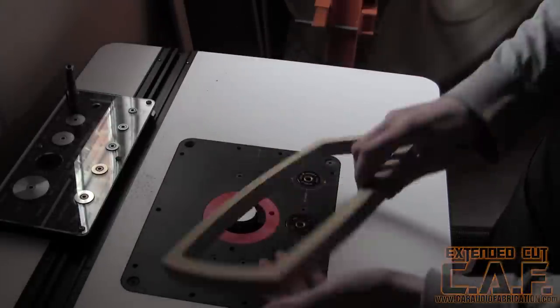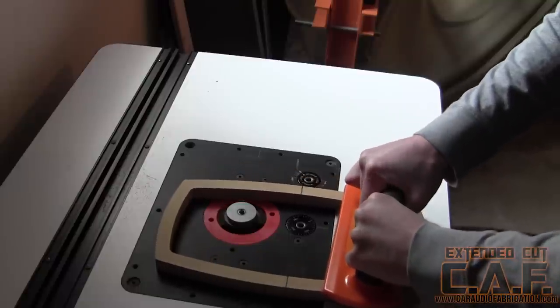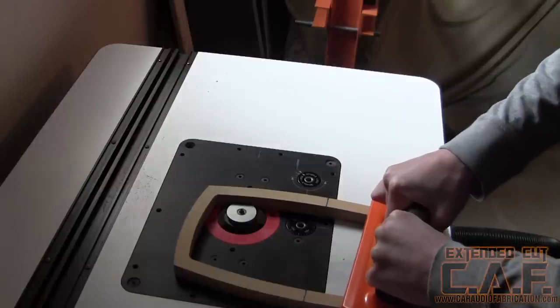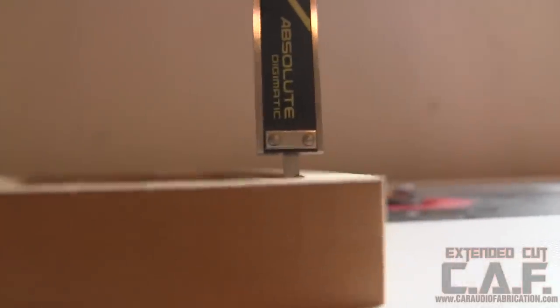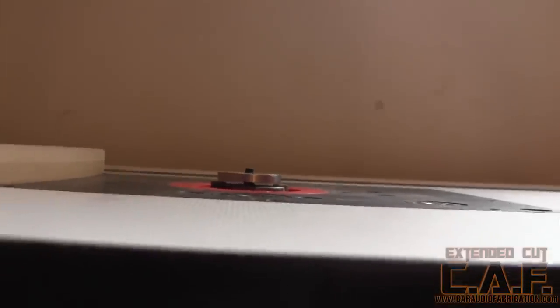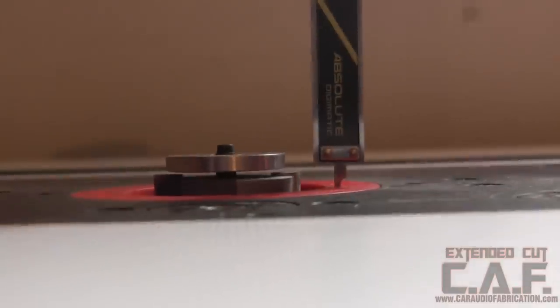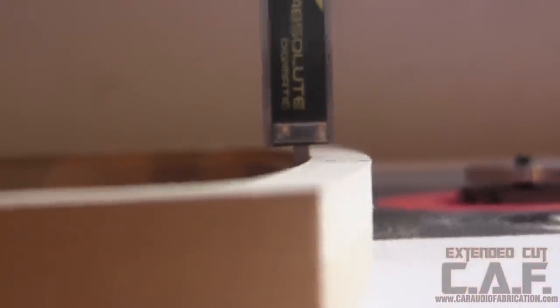And we want to do this on the inside, of course. Move my tray out of the way. See, the groove is coming along nicely. So you can see I've made a cut that's about a third of the total depth. So I'm going to adjust our bit up now. So you can see that's a little bit more. I need to just adjust it that final amount.